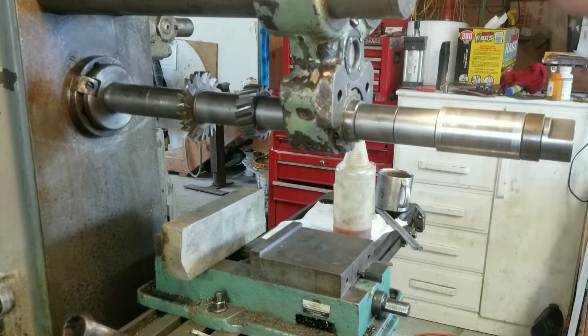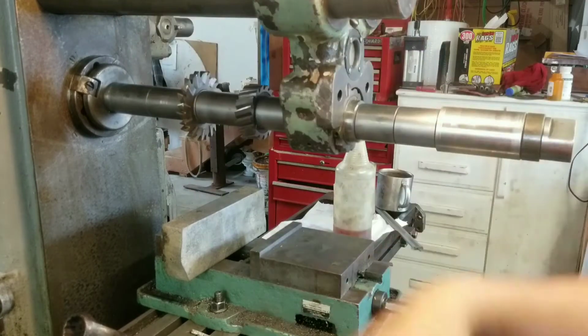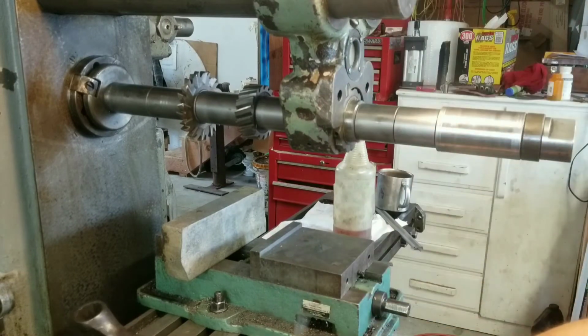And naturally, you guys saw my failures in the last video if you watched it. Make sure every single lock is tightened down. On this particular K&T, there are 3 1¼ inch nuts, one for the arbor support and 2 for the overarms themselves. Make sure they're tight and clean.